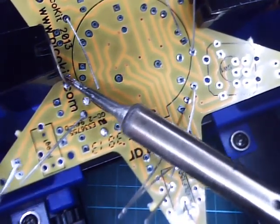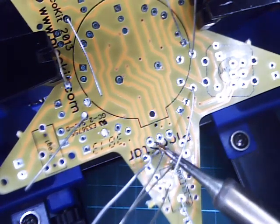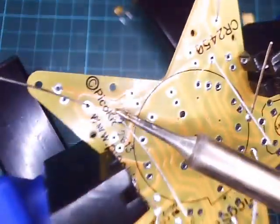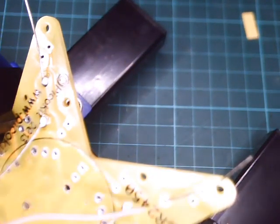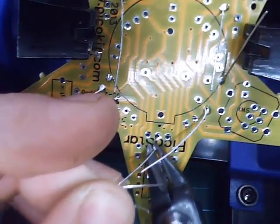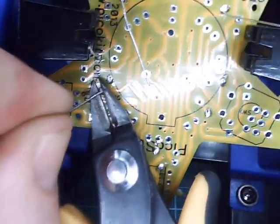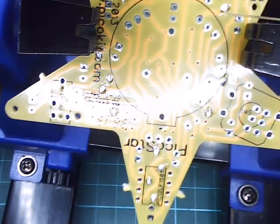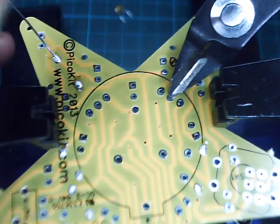Make sure you get adequate coverage of the pad, so that no part of the pad is left without solder. Trim these off with flush cut side cutters — make sure you're not so close that you destroy the pad, but get them down low enough that other components can sit over the top if need be. Always hold the lead so it doesn't go on the floor. It's a safety issue if you get metal leads in the carpet — if people come in without shoes they're a bit like pins, not a good experience. So hold the leads and make sure they go in the bin.